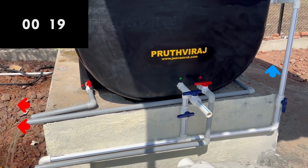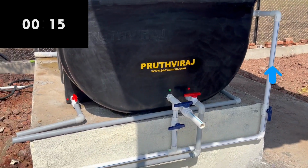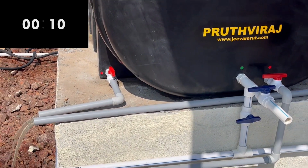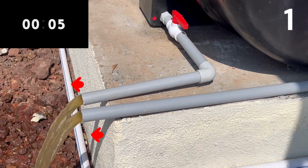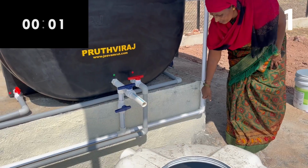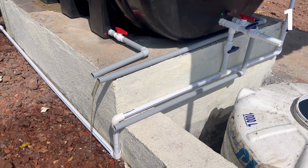Keep adding this water only for 30 seconds. Do not prolong this step, keep it open for only 30 seconds. Water will enter the filter and will also simultaneously keep flowing out from the open flush valves. After 30 seconds, close the water supply and wait for the flush water to get drained out completely.